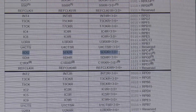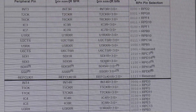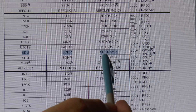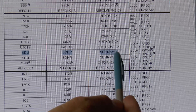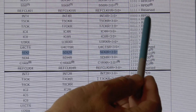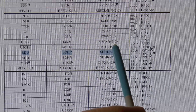This is the input pin selection table: peripheral name, pin name, special function register, and then the R bits — those are the bits you actually have to configure. We want RG7 for SDI2 — serial data in, i.e., slave out master in. There are 4 bits to configure: bits 3, 2, 1, 0. Looking down for RG7, it's the second one from the top. So RPG7 — R-P for remappable — configured to 0001 should make it an input for SDI2.